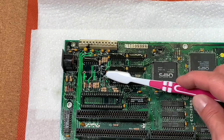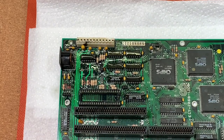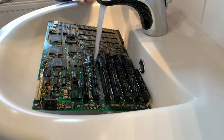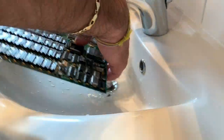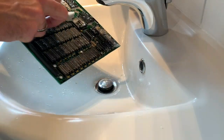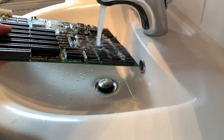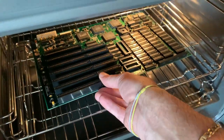Now I think we are ready with chemical treatments and we can go into the wellness area, let's say, to clean up the rest of the board nicely. We just need some water and again an old toothbrush and some bath cleaner to get rid of all the dirt and dust on the board. I can hear you already complaining — you cannot put a PCB or a mainboard under the water. Yes, I can, and never ever in my life was a mainboard damaged after this cleaning, but the outcome is always very nice and very clean. To dry up, just put it into the oven for some hours at about 50 degrees Celsius.